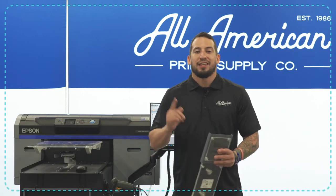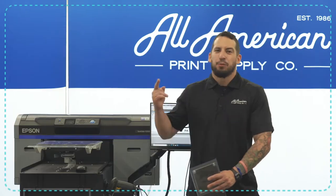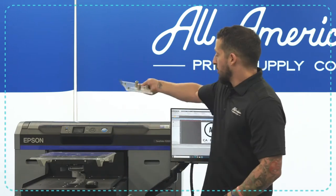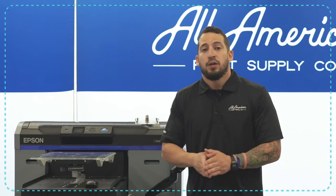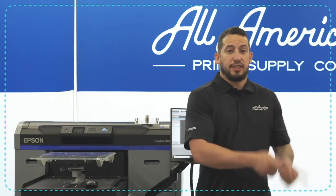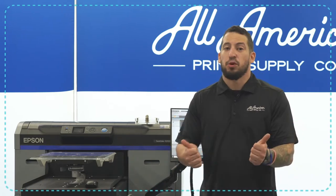Today we're going to be going over live demos on neck labeling, the short sleeve printing itself, and we're going to make a face mask. Before we dive into it, how are we going to install this thing on here? If you're familiar with the Epson F2100, you already know that this ships with a 14x16 platen, which is great for all adult sizes, even into our 2 and 3X. There are available options such as the 16x20, 10x12, 7x8, and installation's a breeze.